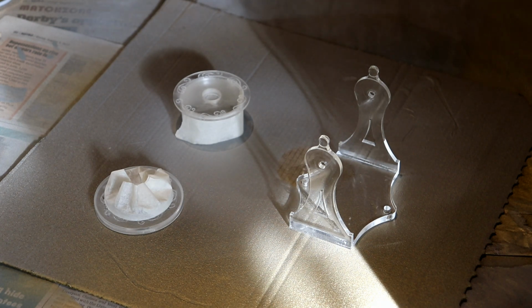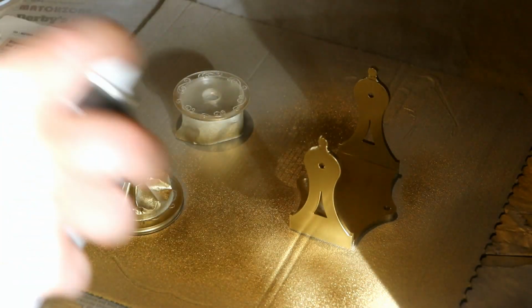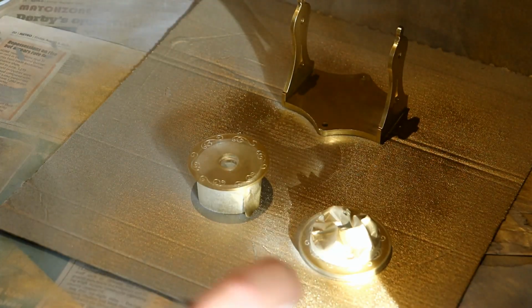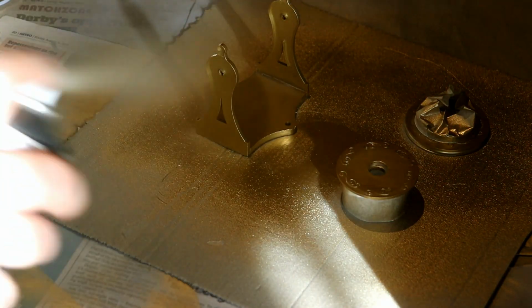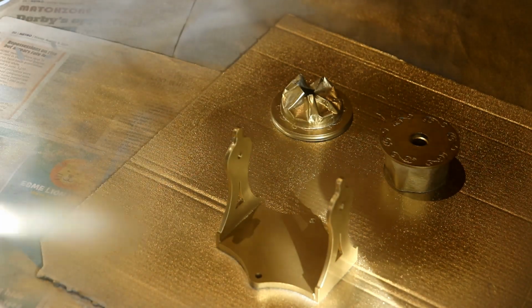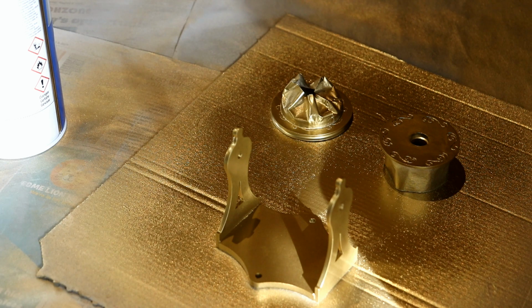It burns and is very unpleasant, but on a daylight day it is a shame not to let a little into the workshop. So we'll spray those. And as I've said in the past, I've found the best way to do it is just to turn them through 90 degrees. The danger always with spraying is if you put too much on too quickly, it will run, and it's so tempting to, because you want to see what it looks like and it makes it look brilliant. But leave that, and this is a lovely spray, you leave it for 5 minutes and it's dry, and then you can put another coat on, and I've found a couple of coats will be quite sufficient.